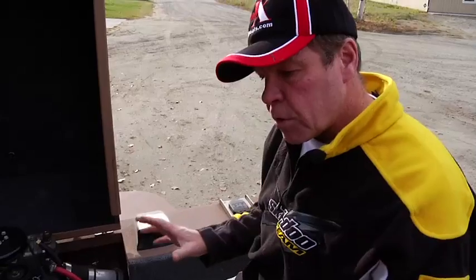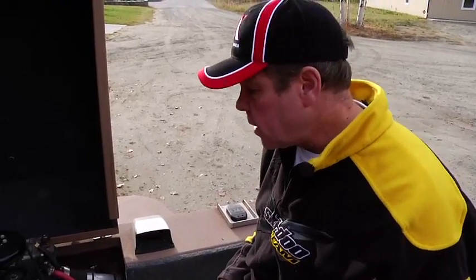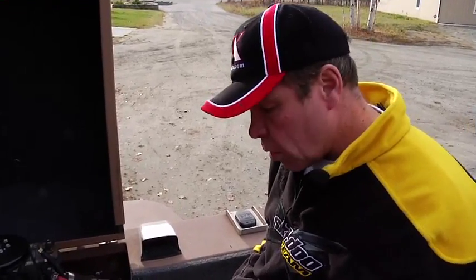Winterization. Okay, if you're in an area where it gets below freezing, you need to winterize your boat. The beauty of the Optimax is the engine completely self-drains. There's no manifolds, no petcocks to worry about. There's just a few small external components you need to address, and it's important you do that. And we'll go over those right now.